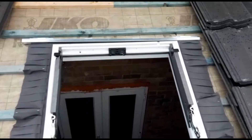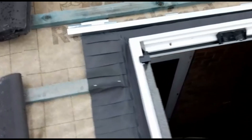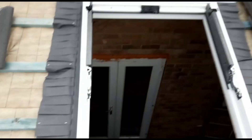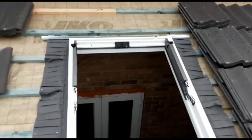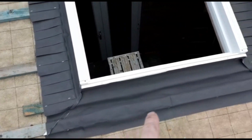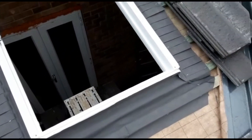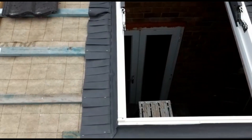The insulation is put round, stepped into position. Also installed the drainage gully at the top, which tucks under and over — clipped in. That's where the under-sarking goes as well, tucked into that. Nice neat job. It's all sealed around the side. Next stage is to start installing the tiles up to this point, and then I'll start putting the flashing on. I'll have to go down and get a cutter because mine's burnt out after all the work it's done — served as proud, but it's seen its day.